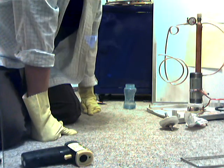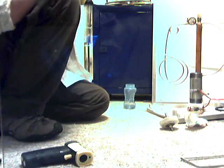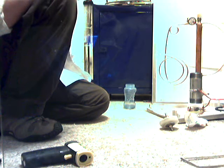The data shows that in 19 seconds this thing boils water — at least it did in the first experiment. In the second experiment it took 63 seconds, as there was more water. Six minutes is how long it ran before it reached 3 amps, with a quarter inch of water left. So you can get about 12 minutes of steam if you fill both reservoirs. Lead solder would probably solve my sealing issue — I used lead-free solder building this thing. Never again.